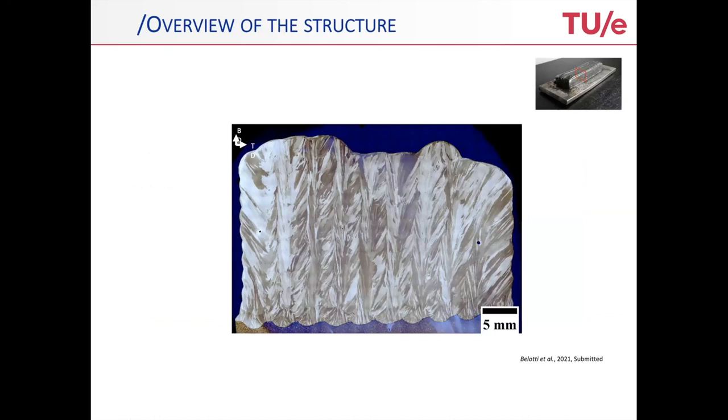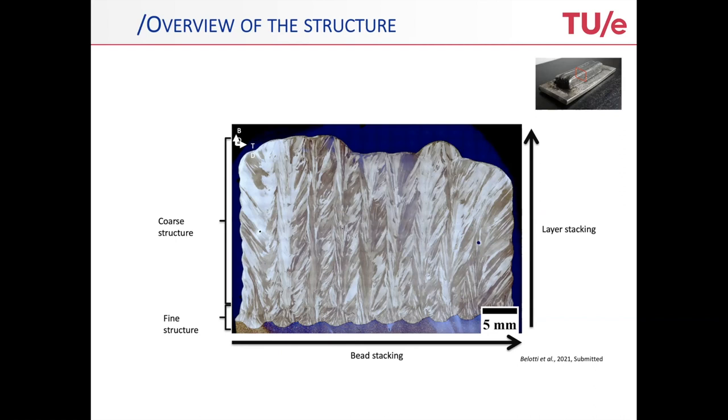If you make a cross section, this is what you observe. I think this connects to what Daniel Resnick already mentioned — he called this one of the real 3D techniques. In the cross section, you can see why it's 3D: even though you're printing layer-wise, the structure builds up with crystal growth that links up to different layers and makes it really a 3D product. You get a grain structure dominated by epitaxial and competitive growth, and those crystals really grow across layers.